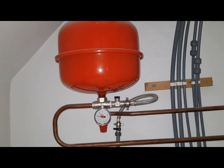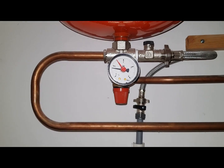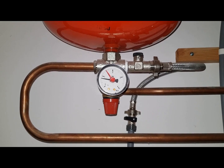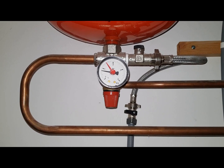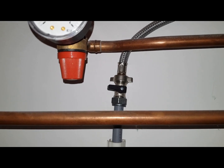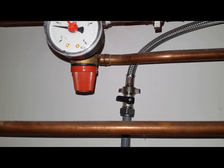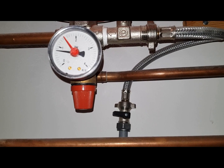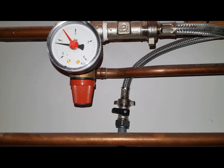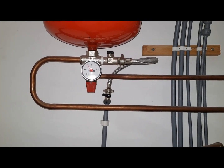The last thing is this gauge — it's a pressure gauge. You've got a sealed system so you need it topped up just a little bit more than it is now. It wants to be just over one, where the red needle is — you need the black needle to be the same. You've got this lever there: turn it to twelve o'clock or eleven o'clock slowly, you'll hear the water go in, and watch until the black needle meets the red needle, then close it back to where it was.